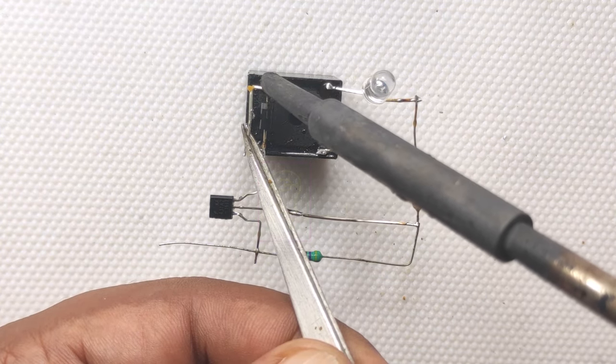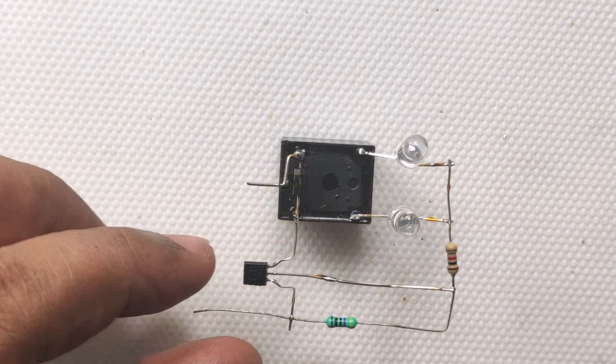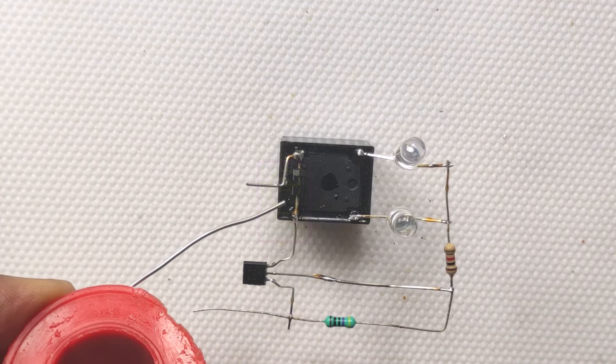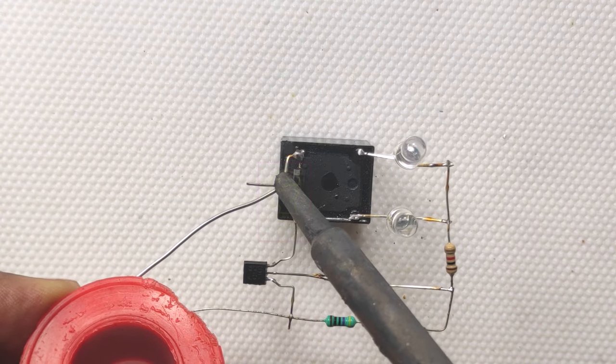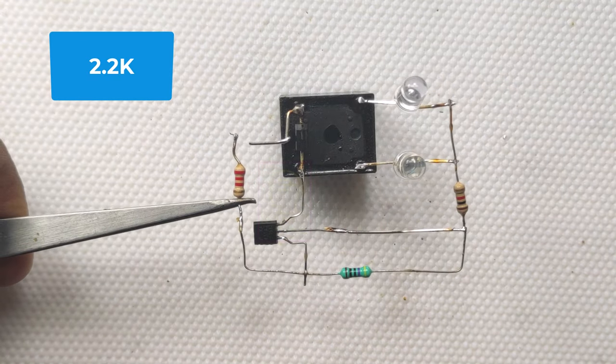When the charging completes, the current flow will become nearly zero and then TL431 will disconnect the output from the input. Do not skip the video because I will be explaining a lot in between the testing time.